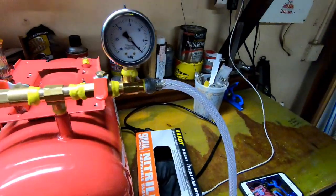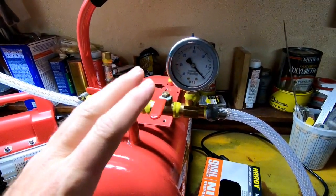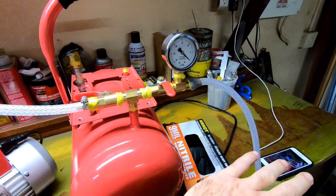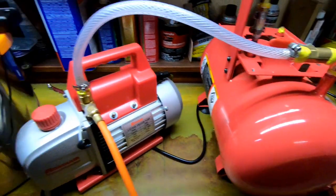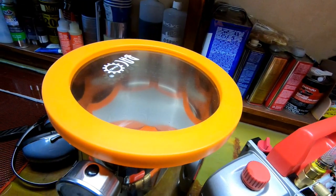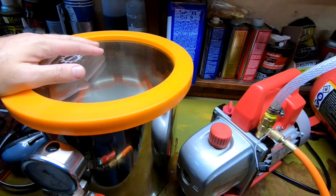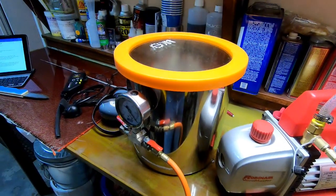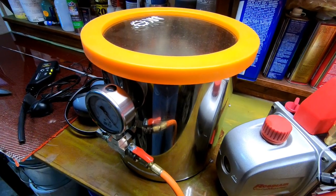On the multitasking side: let's say the pump is running and I'm pulling a full 30 inches. Once it gets to 30 inches, all I have to do is shut the ball valve. After a leak test confirms the vacuum bag is leak-free, shutting that valve is all it takes. With your bag isolated, you can leave the reservoir ball valve open and use that giant reservoir of vacuum to pull down your degassing chamber and degas your resin — which might take 10 minutes — while the bag stays at 30 inches of mercury.